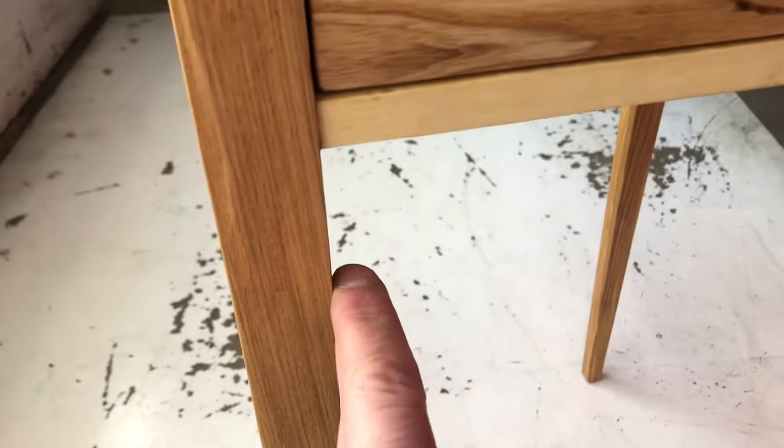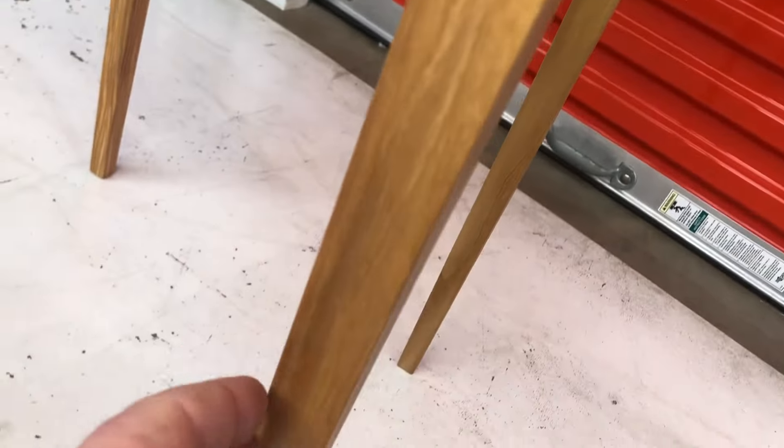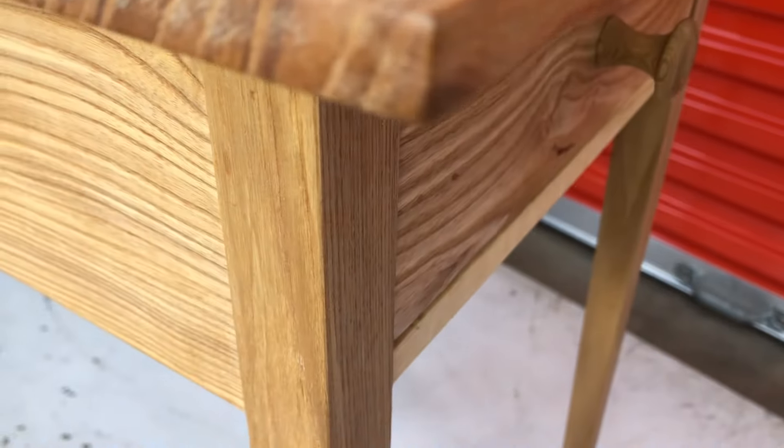There's a taper cut on the inside here and then on the inside here going down. This is, I believe, five-eighths of an inch down here and an inch and an eighth on top.